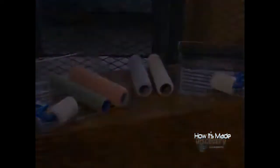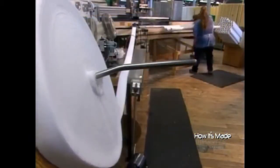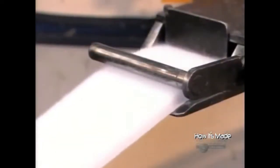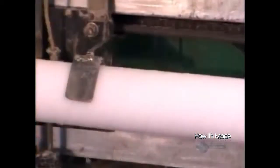The refill is a tube covered in fabric made from either polyester fiber or lint-free acrylic and nylon fiber. Regardless of fabric, all refills are made the same way. The fabric is processed into a 7.3 cm wide strip and goes into a machine called an automatic tube winder. It first applies epoxy glue to the surface of PVC plastic tubes. As a tension bar pulls the fabric strip taut, the machine winds the fabric around a tube. An air jet pushes aside the wound fabric to avoid bumps as more is applied.